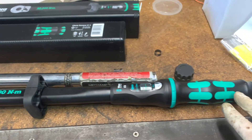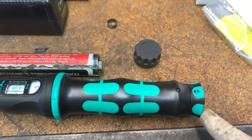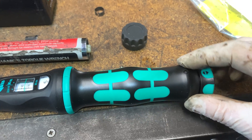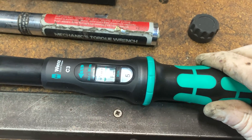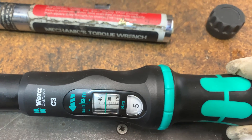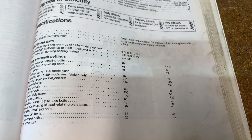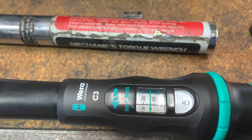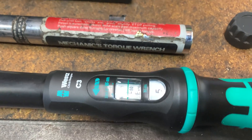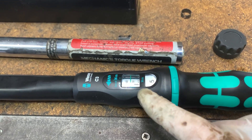You certainly don't want to use this as a breaker bar. At the end there's a locking tail — you need to pull that out a little bit, then the handle will turn so you can dial in the figures you need. Everybody over the last 35 years seems to have gone to Newton meters. If you look in the Haynes manual, they do say Newton meters as well — I always use foot-pounds, but it looks like I've got to migrate over. In smaller digits on the left-hand side it is still in foot-pounds.